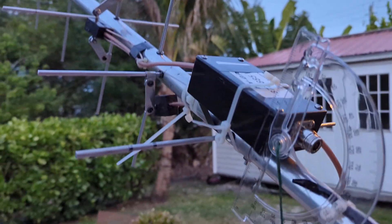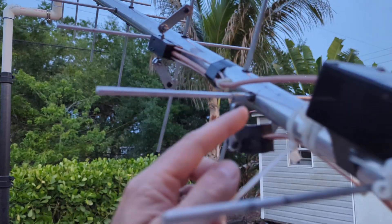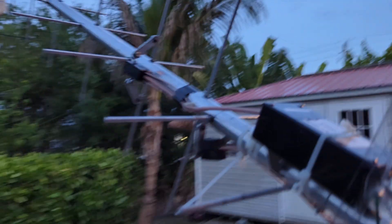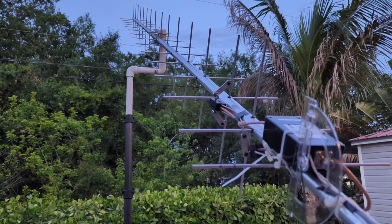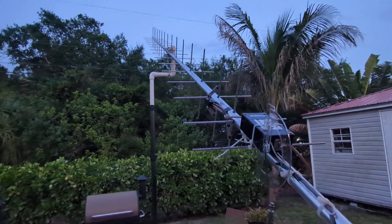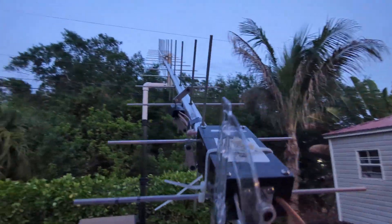When I switched the circular polarization circuit, it goes up to about 1.35 SWR — I'm not sure why. The only way I got it that close on SWR: this one about an inch and a quarter from the boom, where the manual says I had to get it as close as possible — that's the only way it would tune. So that is an update on this antenna. I am going to show you that I can decode. Tomorrow is a DXpedition EME event; there's going to be a ton of people bouncing signals off that moon and I want to be a part of decoding those.